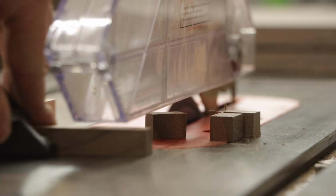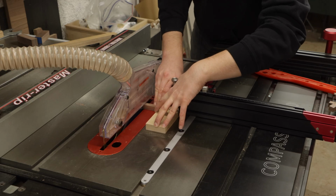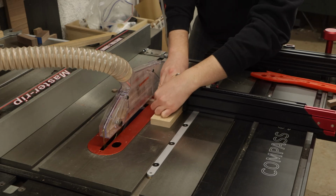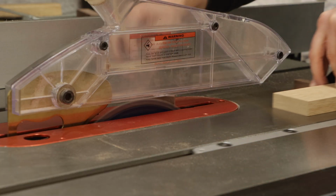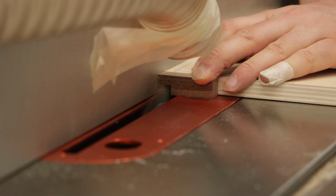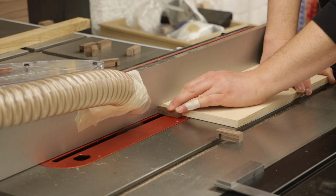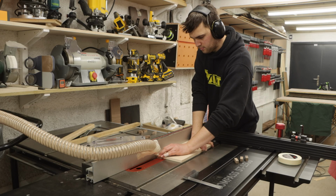So yeah, I do use the vacuum bag a lot, and I also use the Festool Domino a lot. However, in this project, I did not use the Festool Domino once. I used a method that I very rarely use, which is tongue and groove. Well, to be more accurate, it's probably groove and floating tongue. About 90% of this project is joined together with a tongue and groove.